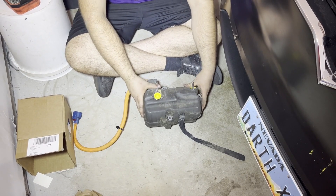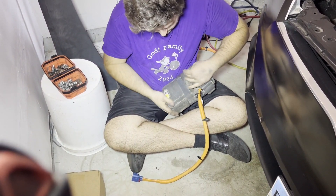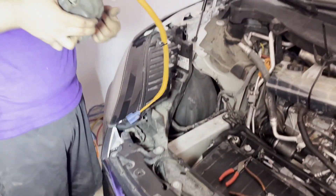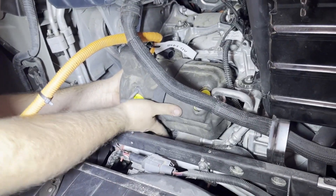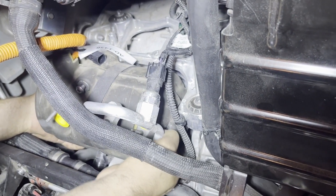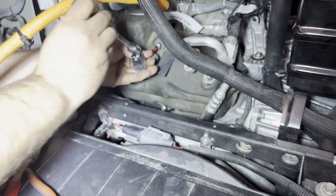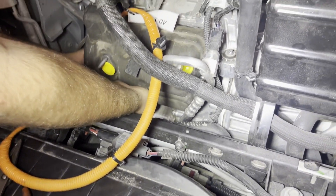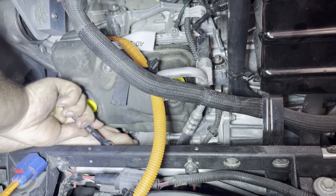I like to keep the caps in so you're not contaminating anything — take the caps out once you're all in and there's no dust flying around from tightening bolts. Don't forget your bottom bolt — all the bolts are the same, you don't have to worry about that. Start the thread on the bottom, get it started, make sure that bottom one is started and then you're good for the wrench. You kind of have to jiggle the whole unit up and down because it's going to be resistive in a few spots. Do the hardest bolt first and just snug it up as tight as it was before.